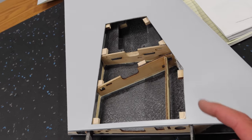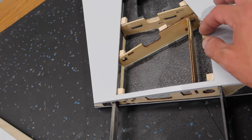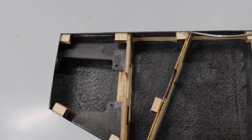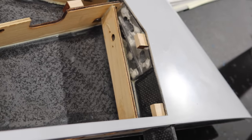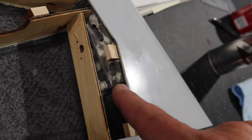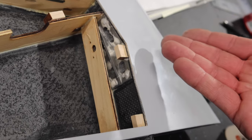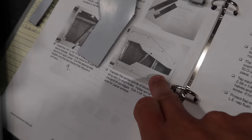We've got all of our little maple blocks installed in each wing — nine of them in total. We used a combination of Hysol and CA. I don't like using just CA on these because it tends to crack, especially when you do up the screw. We used Hysol to get it glued in place and then CA just to spot-hold it. Afterwards we'll come back with a Dremel bit once it's cured and sand down the CA and Hysol that's oozing out.